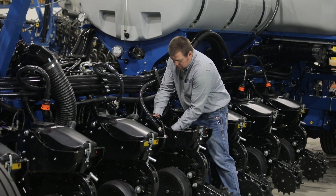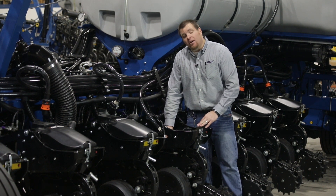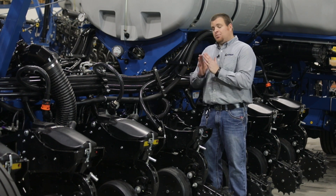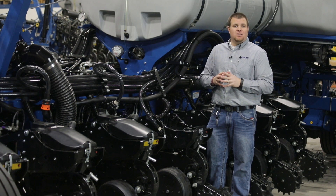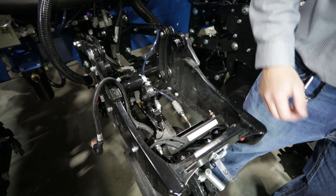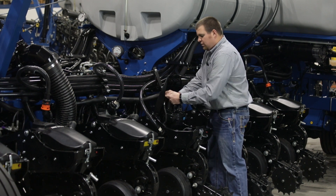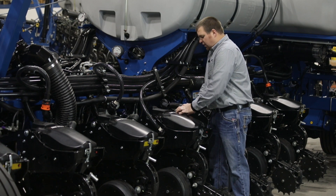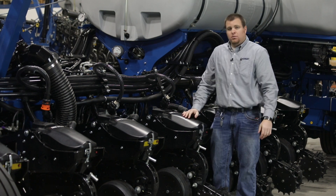We have a single connection for our delivery tube. As you notice, when you push front to back on the row unit, the delivery tube is spring loaded. The big function of that is when we rotate our mini hopper down, that spring tension helps ensure we align both horizontal and vertical and make sure there's a good, smooth, clean face on that interaction. So we put our mini hopper lid back on, with our puck design and kickstand you can put that up so it holds. Put our electrical connection back in, lift our kickstand up, rotate that down, take our vacuum hose, reinstall it onto our mini hopper, bulk fill back on our swivel connection, latch it down, and we're ready to go to the field.